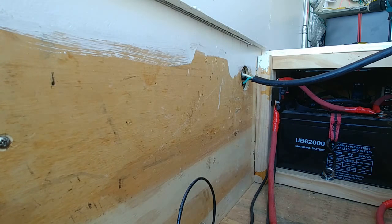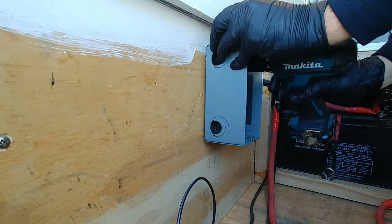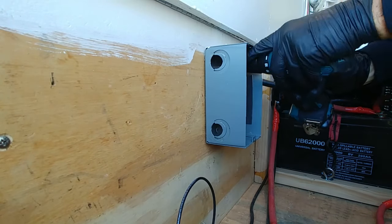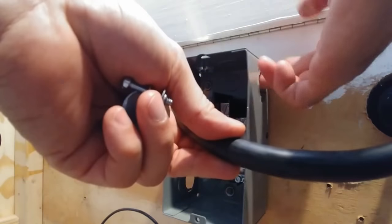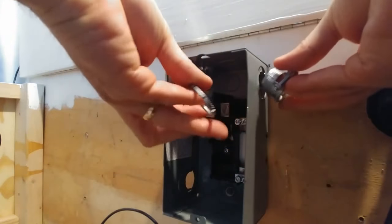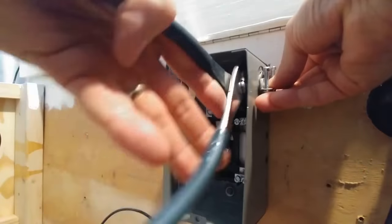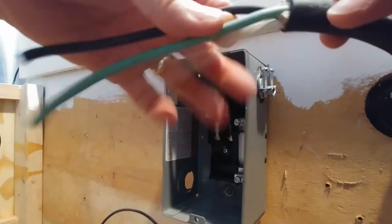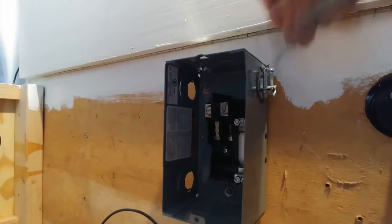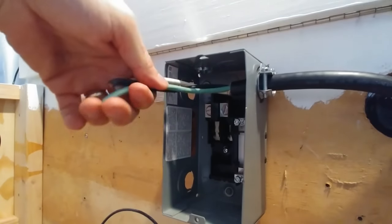I'm going to install the box by putting a screw through the hole in the box inside and screwing it into the wall. So we've got our box mounted and our cable here. This cable is going to have to go through this hole, but first it needs a cable clamp — this is a three-quarter inch cable clamp — and it screws into the box. We've got the insulation stripped off, and now we're going to lift the clamp up, feed it through the clamp, and tighten the clamp down.